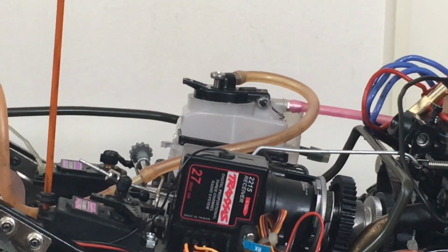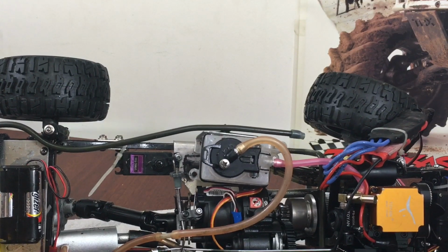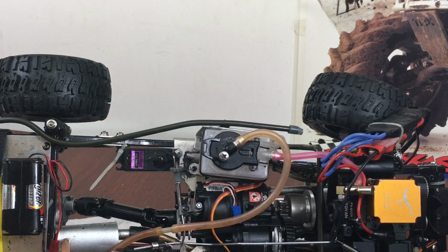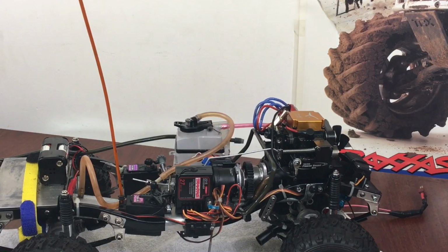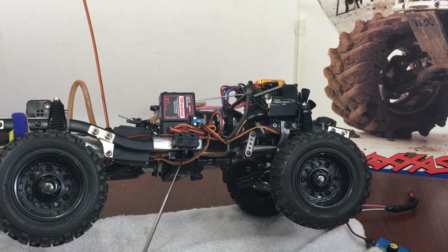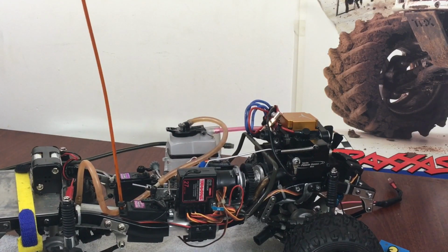Get a close up on this side of the plate. This one here tilts down a little bit because I tilted the transmission so I could eliminate my front drive shaft binding. It's just regular hobby grade aluminum, and I bent it up real nice, and I used the existing holes for the cross member, and I dropped the cross member down. I just put the bushing inside it, and I drilled a hole in the aluminum plate and put the screw down just to pull it up here. I will make proper pieces once I get a working setup that works great.